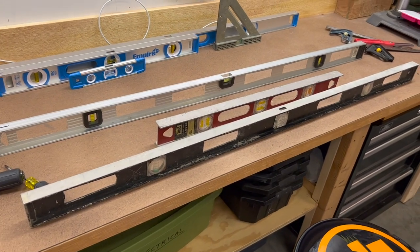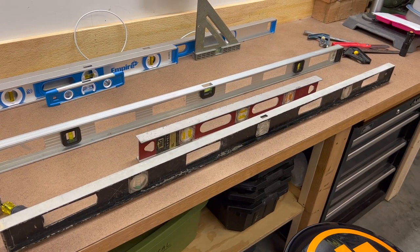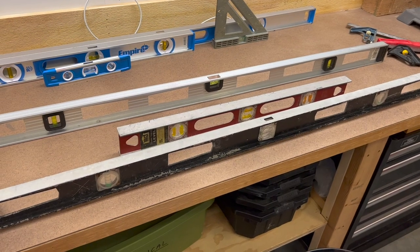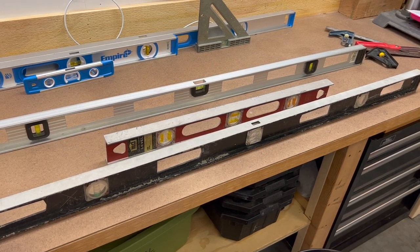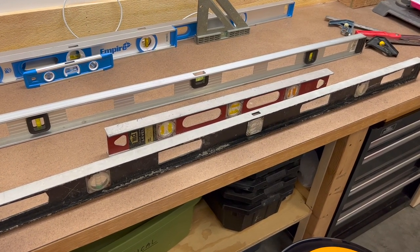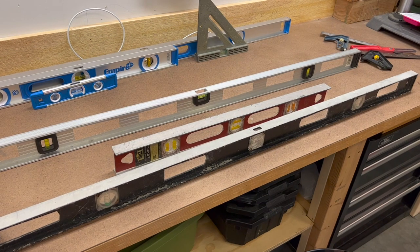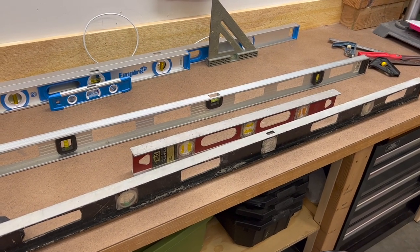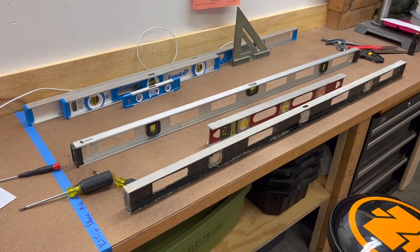This last level only has two screws on the center vial and the end ones, but this will be the same deal. The screws aren't threaded into the aluminum here - they go through to the other side - but when I loosen these up there will be slop in that mounting window to allow calibration just like the others. Hopefully that's some useful information on how levels work, how to use them, and how to readjust them when they get out of whack. The main thought I want to leave you with: don't just blindly trust a level, whether it's new at the store or an old one. Do a quick sanity check before you use it - put it down on a surface or against a vertical surface, flip it 180 degrees, and make sure you're getting the same reading in both orientations. Do that often, certainly before you start a new job or anything important. These are invaluable tools for all sorts of projects. That's it for today, thanks for watching.